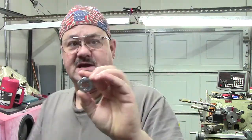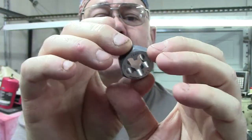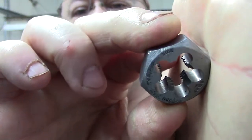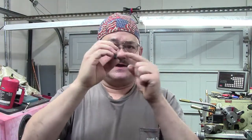Case in point, I have an old Sears Craftsman tap and die set. You can see here — that's a 12mm. It says 'start from this side.' If you look at the grooves or the thread cutting area in there, see how it has a ramp in. So think of it like you have a roughing cut at the beginning with a taper in, and then you have your final cut on the back. So that's a cutting die.